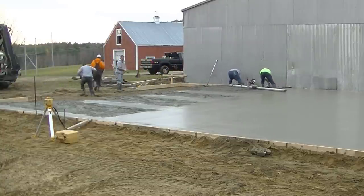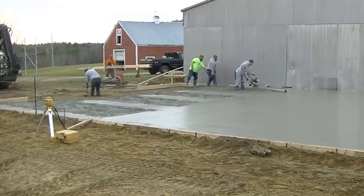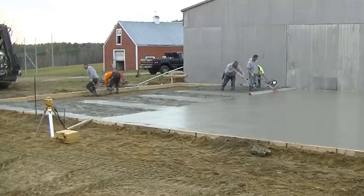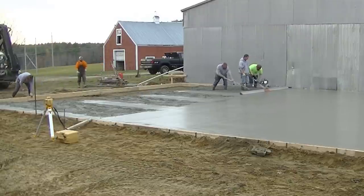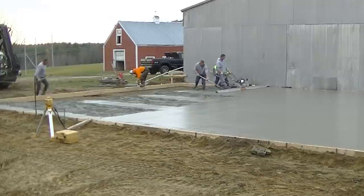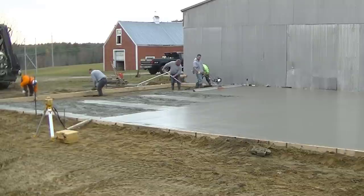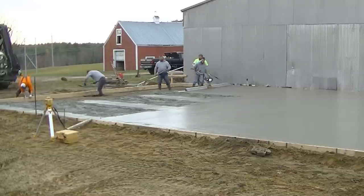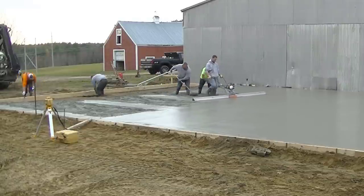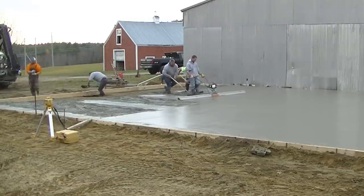For most pours, I'd say we're probably a yard every minute and a half or two minutes. I think we're pretty fast for the size crew we have. Harvey's getting that form — we're going to put it back on and check the grade to make sure it's set right to grade. You can see how we strike those wet pads in the middle to go by — that makes screeding really easy. No pipes, no two-by-four on stakes to worry about. We go by the wet pad and that's how we get our floors really flat.